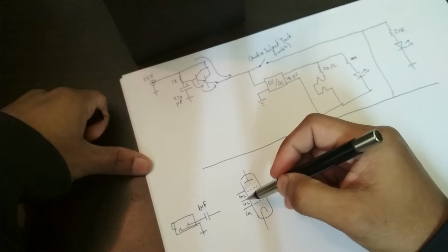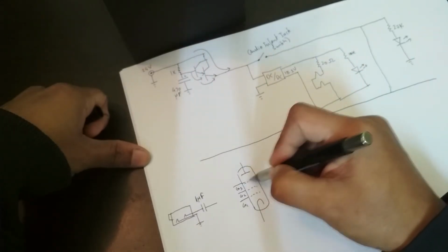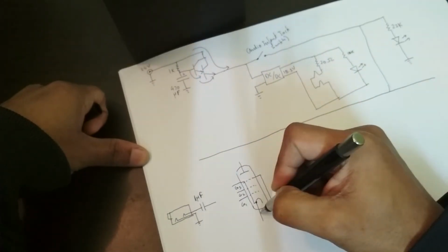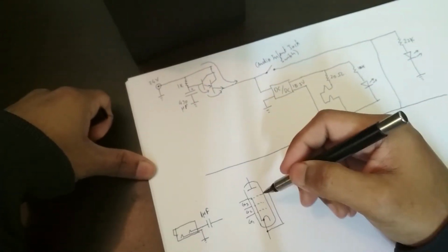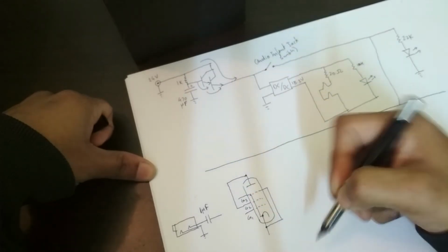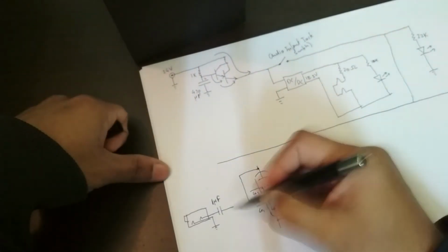All right. Now in addition to being a pentode, the 6J1s are actually sub-miniature pentodes, which as far as I can tell just means that G3 is internally connected to the cathode. It does have a pin of its own, so just for good measure I've connected it externally as well. Now I'm using the pentode as a triode, and the way you do that is you just connect G2 to the anode like that, and so now you have a triode. There's your anode, G1 is your gate or grid, and this is your cathode.